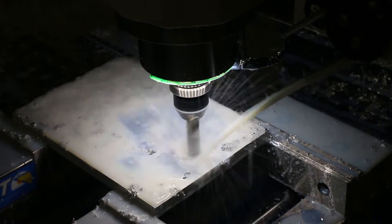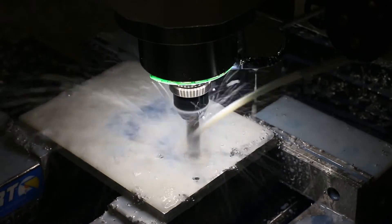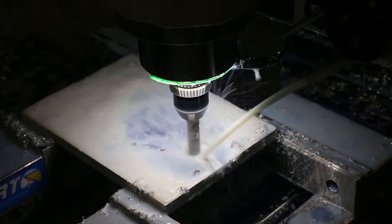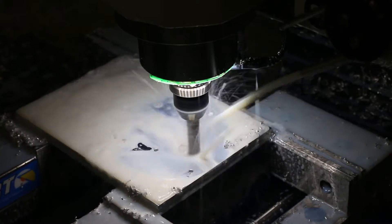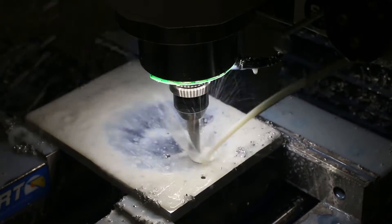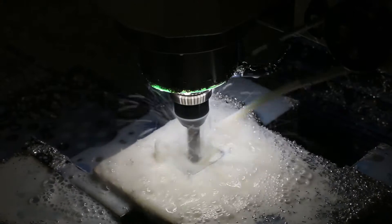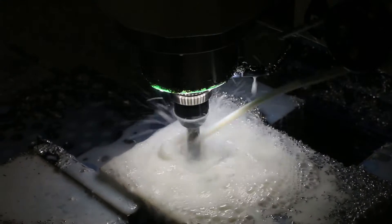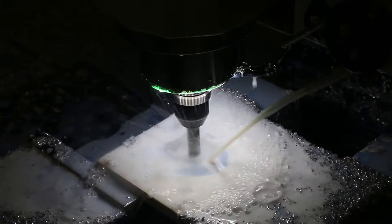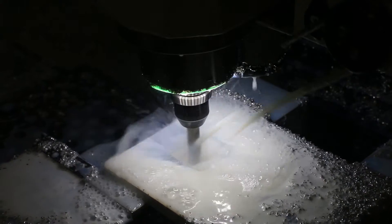This is all within the post processor in Fusion, taking into account the height of the tool sticking out of the collet holder. I need to compare the numbers in the code to see whether it's using the full stick-out from the tool holder or just the height of the cutting edge. We'll jump forward to a spot where the pocket is a little deeper to see how it's clearing chips. You can see that up-and-down motion really works to drive chips out of the pocket.